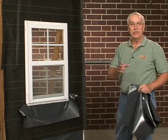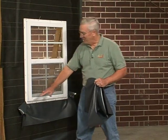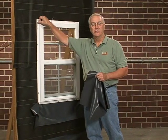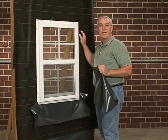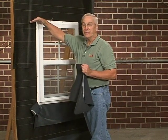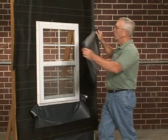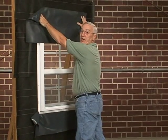There are several types of flashings you could use for this application. Imagine now that the brick is laid up to this point on both sides. What the mason would do then is lay an angle iron or a lintel across the opening, and it should extend at least four inches past the window or rough opening on each side, to allow for support on the masonry on both sides and to carry the load of the brickwork above the window. That being the case, the flashing should be a little long as well. Any water that this flashing catches will need to be directed back to the outside. And remember, everything should shingle.